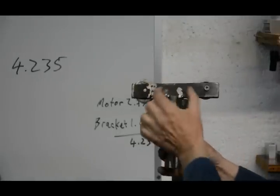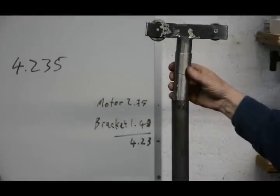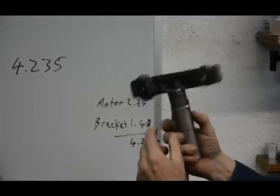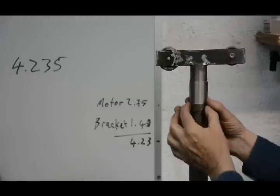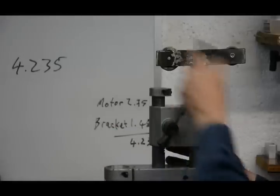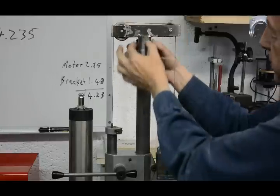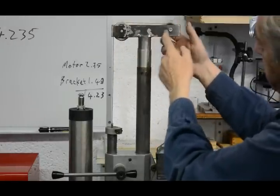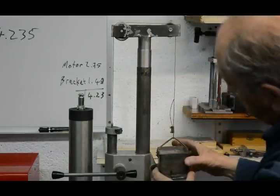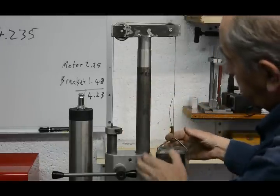Now onto this bracket, I just welded a tube which was part of an old bicycle, which was a perfect fit in here. And then I had a tube which telescoped over that, which I just tack welded here. So this tube is just extended upwards from the original column, so that when this is at the top, there is clearance. It just so happened that when I welded this top piece onto the tube, I did it such that the cable spacing out from the column was such that the counterweight was clear from the column.